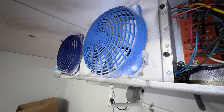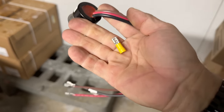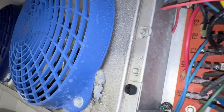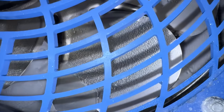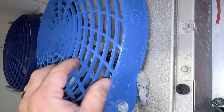Let's go get the switch and get it put in there. Got a brand new fancy 5709 defrost termination switch. Got a little crimp on here. You definitely don't want to hook onto this wire — you'll get your poop in a group real quick when it shocks you. We are right now at 23 minutes and although the back looks pretty good, the front still has some build-up on it.